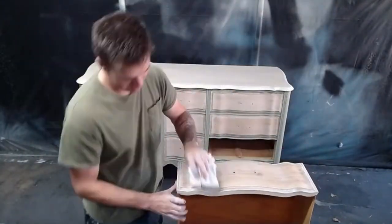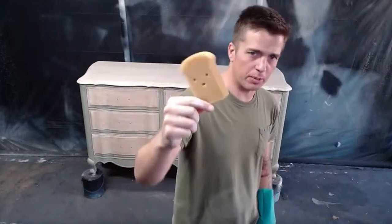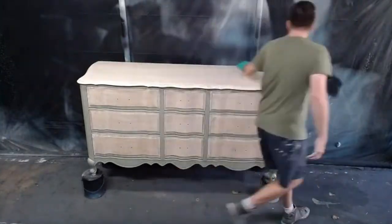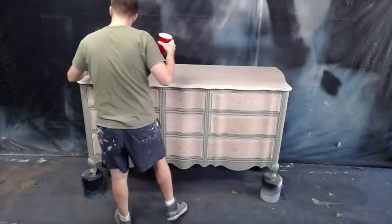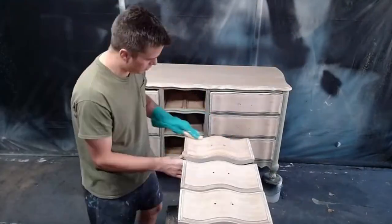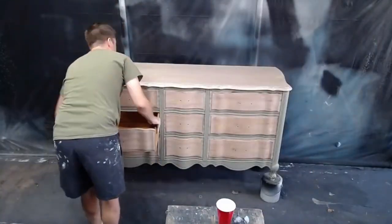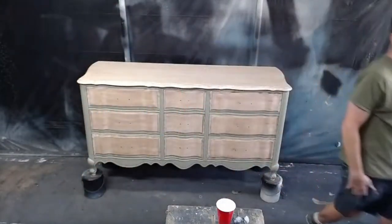After giving the top and the drawers plenty of time to dry, I was ready to apply my top coat. I'm applying water-based polyurethane with my toasty sponge. First, I dip toasty in some water to get him wet, then dip him in the water-based polyurethane and give him a little squeeze to get any excess out. I apply it in very thin coats and take a step back to make sure I'm getting good coverage as I go along. If bubbles are left behind from the texture of the sponge, I lightly go over the area again before it dries and it cleans up those bubbles for a smooth finish. I did two quick coats, allowing it to dry about 30 minutes in between each coat. Because I'm applying in thin coats, everything dries to the touch really fast, but it'll still need a few more days to fully cure.